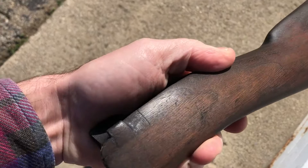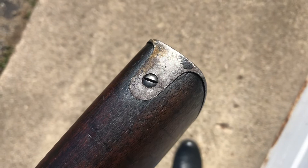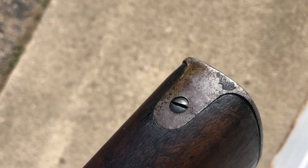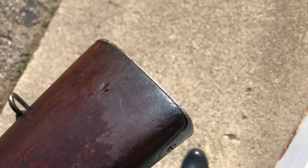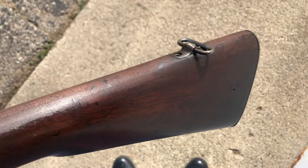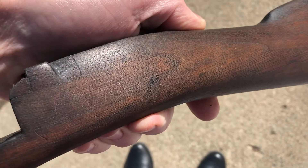I do think it's definitely had a repair there, and I'm thinking it had a repair right there too. You can see the steel — there's that varnish-like stuff on kind of half of it, and it's started to wipe off the other side. There's some sort of tar-like substance right there. The degreaser I'm using isn't quite the right thing to dissolve that, so I might have to get that black gunk off with some lacquer thinner or something before I steam that butt plate. But I think it's gonna come together just fine. I like the way the wood is looking beneath — you can see that walnut grain character right up in this area too.